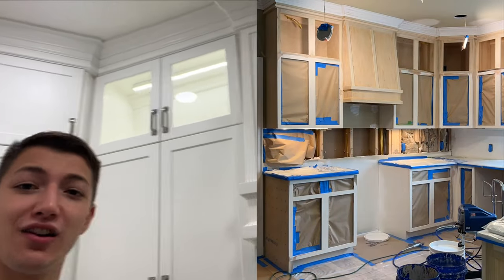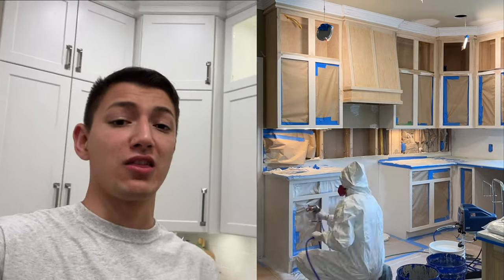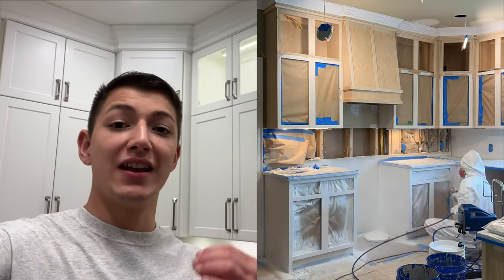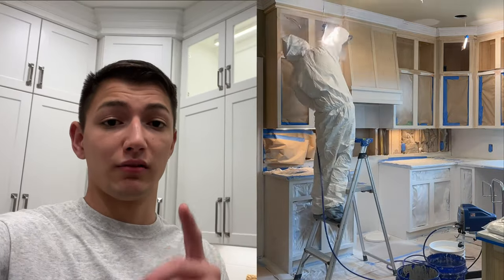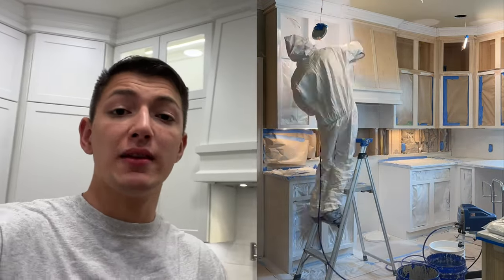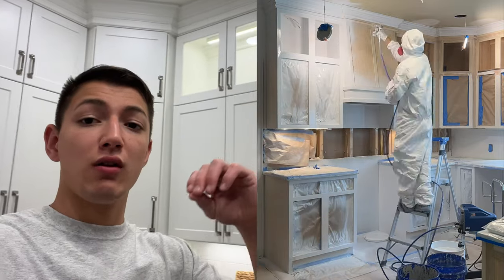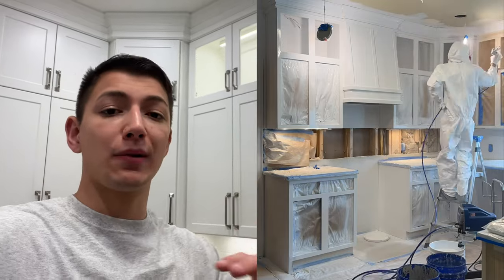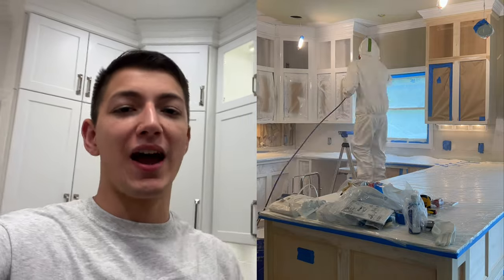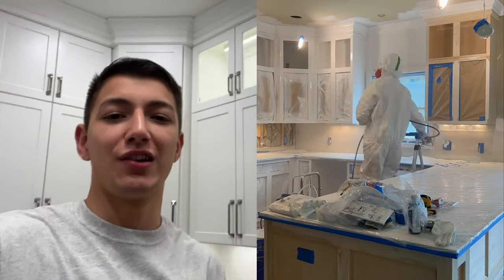When it comes to applying the paint, there are a few different ways. I decided to spray paint all my cabinetry because it gives a much smoother factory finish and goes really quick. There are a lot of affordable paint sprayers out there, so do your research — it's worth investigating. If you're uncomfortable with that, you can still get a really good finish with a brush and a roller. Brush and edge out your first coat, then roll everything else in between. Once that's fully dry, come back and lightly sand it smooth — you're not removing the new paint, just smoothing it out — then do your second coat for much better results.